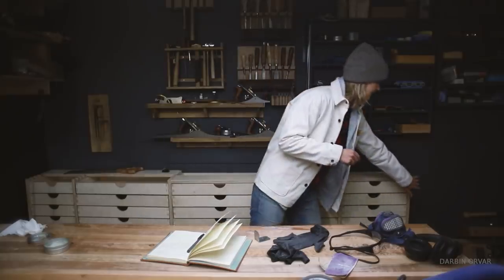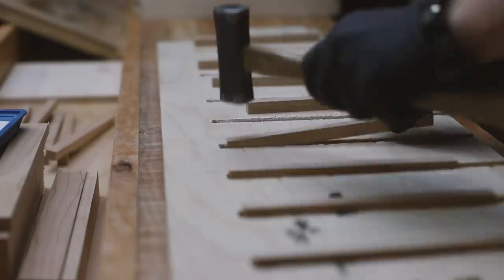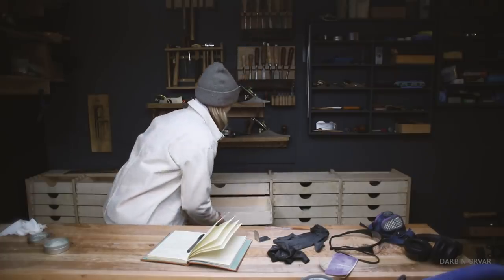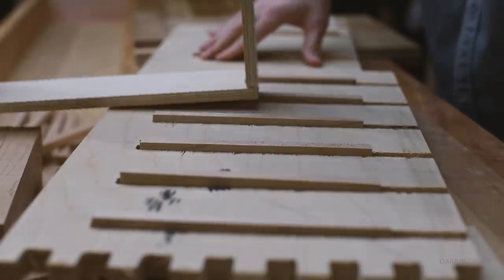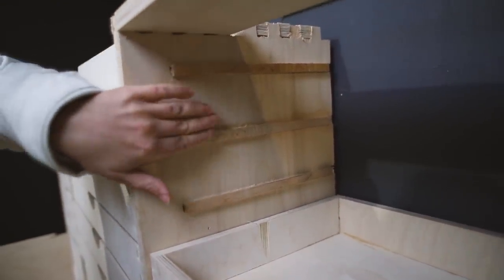On the far sides I only had the groove cut halfway so you could glue it in but not see it from outside. By having the groove go all the way through and gluing in a drawer slide that protrudes on both sides, it lines up perfectly. Both sides utilize the same piece of wood for the drawer slide, and the drawers have a groove cut out that rides on that slide — no extra space wasted, very clean and efficient.